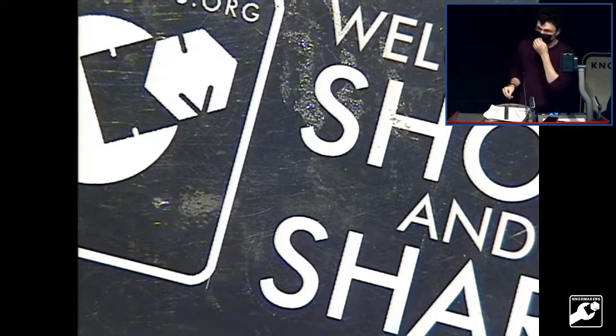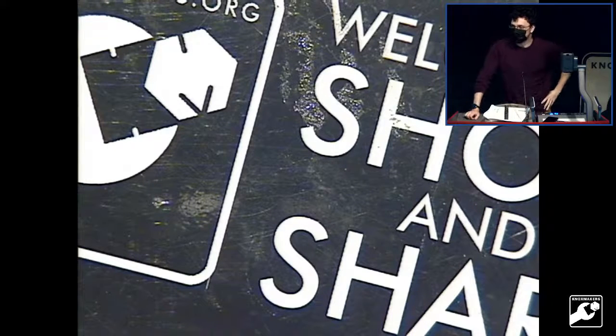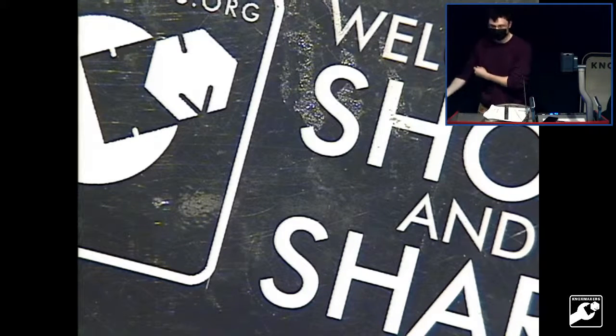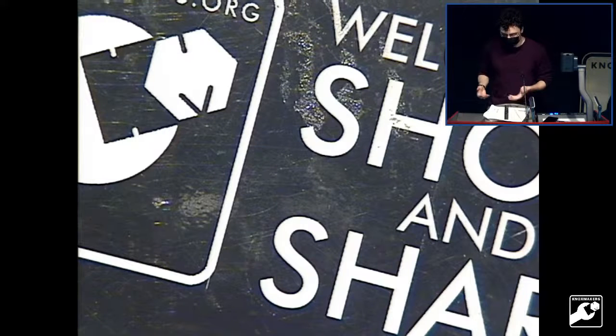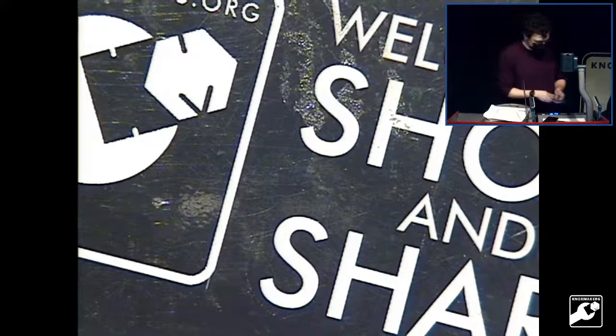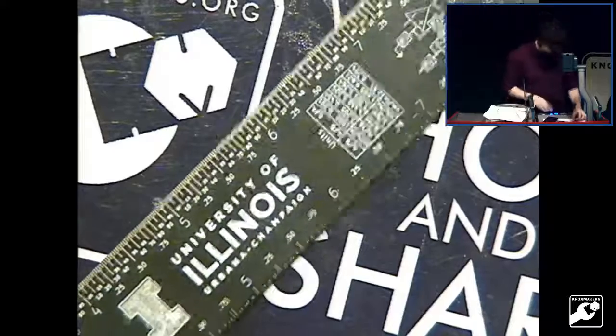Tricks you can do now that you have a microcontroller, special functions or anything extra you can do? You could do lots of stuff. If you were into, say, DJing and you wanted to do some weird sound effects, you could programmatically change the speed, have it speed up and ramp up and down automatically. But the biggest thing is, now that you have access to all this computing power, you could shrink these giant boards to a tenth of their size into a single chip. What they use 3 or 4 ICs for, you could just do in a single microcontroller that costs $1 nowadays.